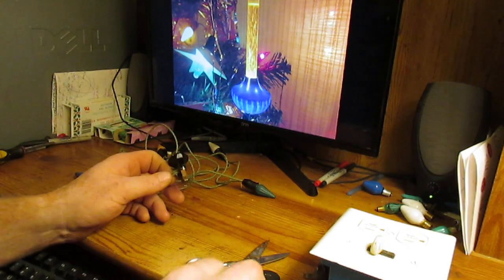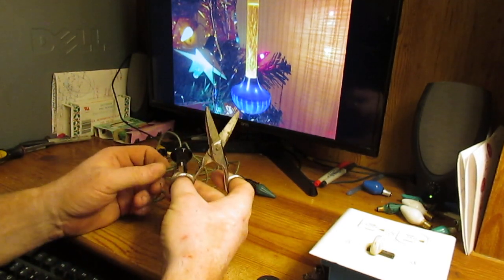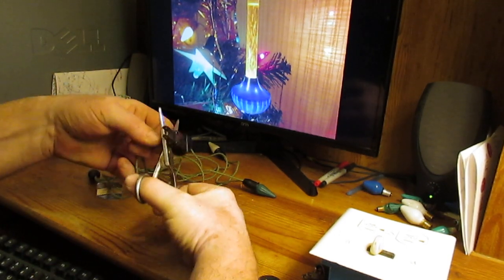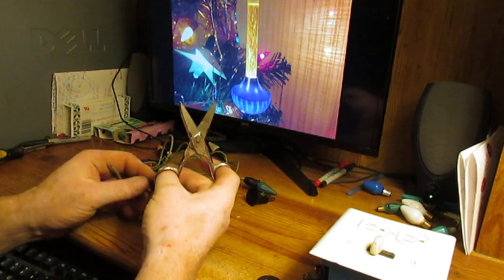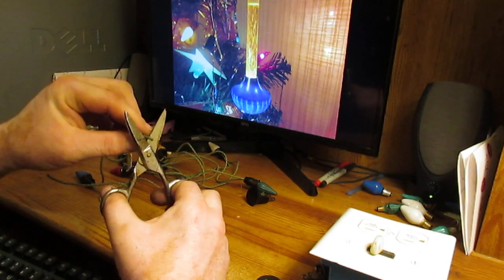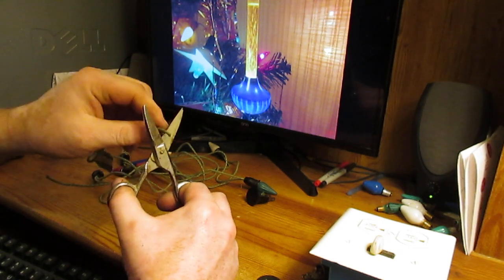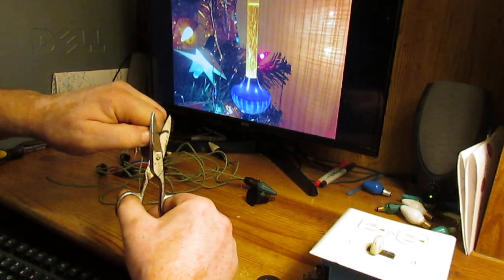We're gonna take this old pair of scissors that reside in my toolbox in my garage and try to clip these old wires off. That does work. It's going to take some finesse to strip this wire because these are cloth-insulated — you kind of have to cut your way around the insulation without cutting the wire, which might prove to be a pain.